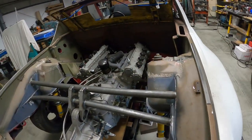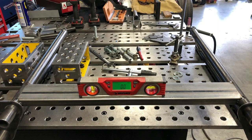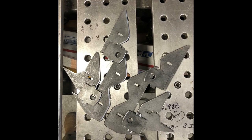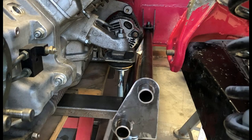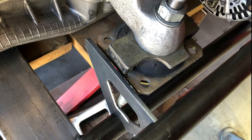With the positions of everything known, I could tack the crossbar to both sides of the engine cradle, then check for level and make sure everything was positioned correctly before mock-up in the chassis. Then I finalized the design and cut new versions of the firewall tab set. With the cradle all tacked together, it was back into the chassis to make sure everything fit and the clearances were as expected. Then I designed and cut the side plates for the engine mounts — couldn't resist stuffing them in place just to see how things were going to look. You get a feel for how things are starting to look and couldn't be happier with how it was all turning out.